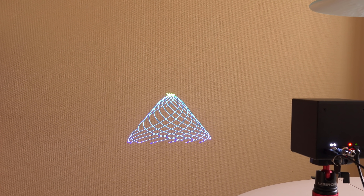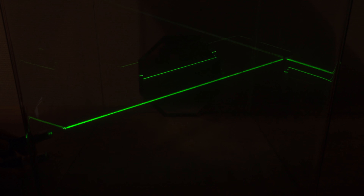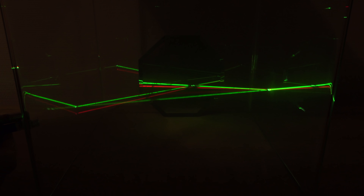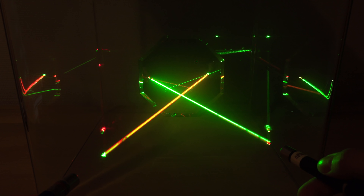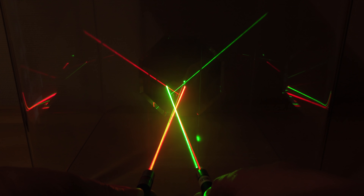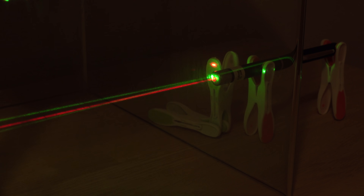How do they manage to combine three lasers into one powerful and colorful beam and move it around? If you have ever played around with laser pointers of different colors, you know it is fairly easy to point them at the same spot to mix their colors — here I use a red and a green one to make a yellow dot, but it's not a yellow beam. This seems physically impossible to make since the lasers need to be in the exact same place at the same time, pointing in the same direction. You can point the lasers directly at each other or make them reflect into each other, but it will overheat the lasers. The red laser even turns off when the green one hits it directly.